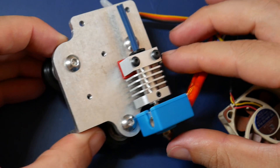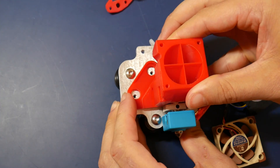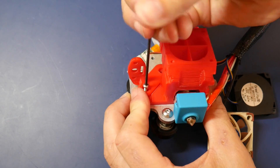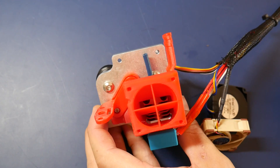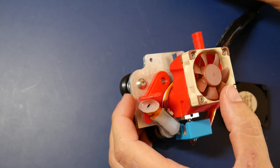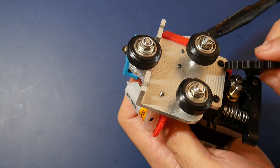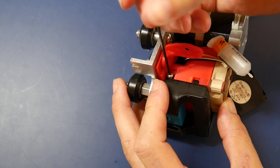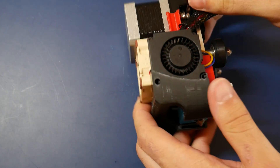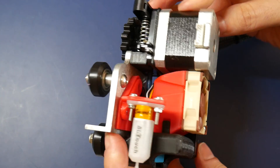That means it's going to be easy for you to use. We reinstall the hotend with the new narrower hotend spacer, then with the stepper motor not yet in place we can slide the base down from above for a really nice snug fit over the hotend. You can use whatever ABL mounting kit you were using from the Hero Me previously, clip it into place and retain it to the X carriage with the two bolts. If you weren't using auto bed levelling simply use the blanking plate. Now is a great time to put your hotend cooling fan back in place. You can then realign the PTFE tube, secure the extruder to the X carriage, push in the extruder wheel, slot in the cooling duct, retain it with the two M3 screws, reinstall the part cooling fan, and finally screw back on the BL Touch. With this in place, the hotend and extruder assembly is complete.